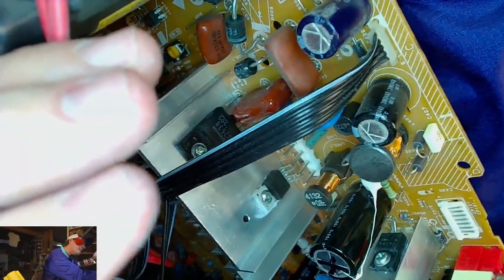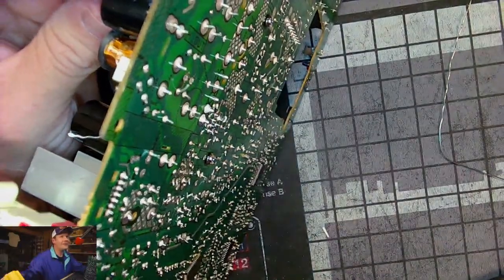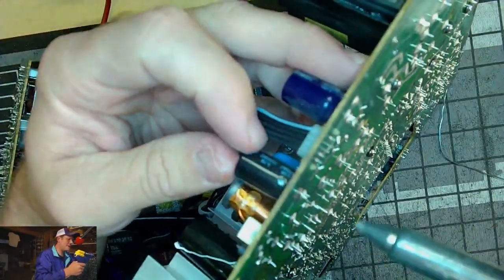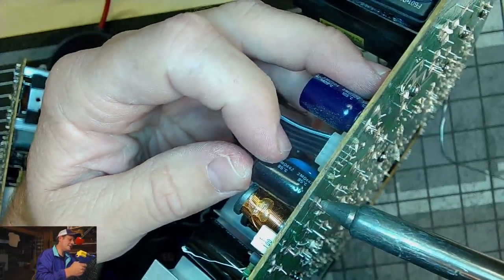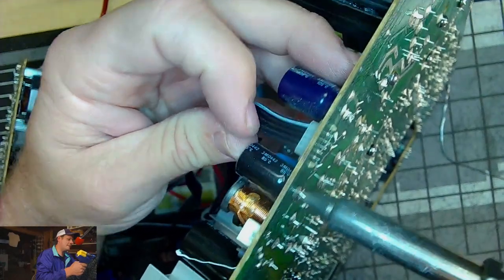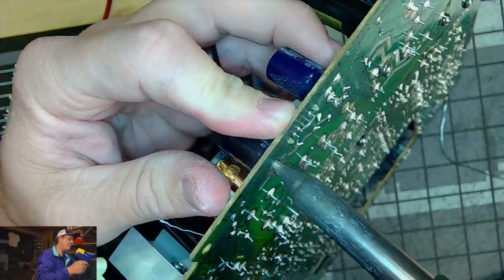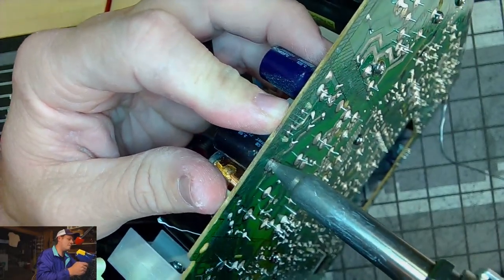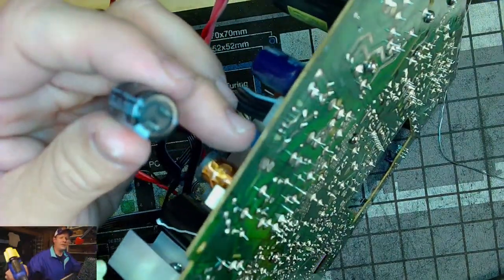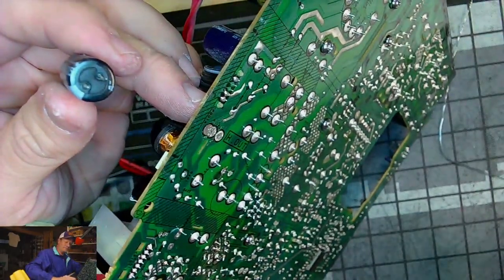All right. We've got C413 up here, it looks like. That's what we're going to take now. Yes, this one does have S video. It has the color stream. So that's Toshiba's early version of component video. All right. 35 volt 1000 there. Mark that down.